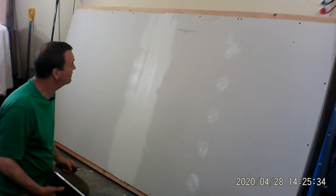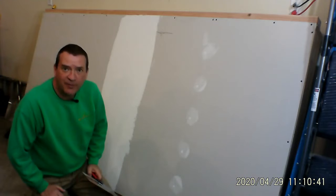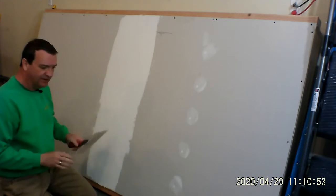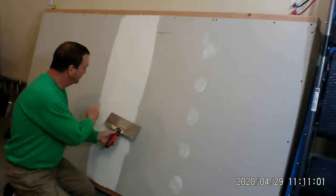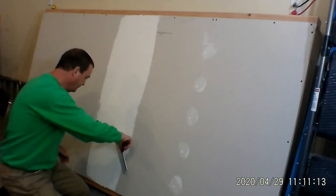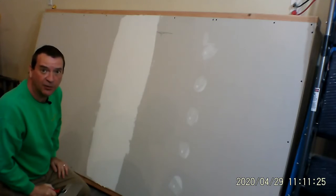When this is dry, we'll come back and take a look at it — probably knock down any high stuff and put on our third and final coat, but we'll take a look. It might need more. We're back. The second coat looks really nice. Now we've got some rough edges here on the side. I'm going to use my ten-inch knife on this — you can certainly use your eight-inch knife, it doesn't make a difference. I want to feather out just a little bit further on both sides of the middle seam, just to knock down any high spots. Now we're ready to apply our third coat of mud.